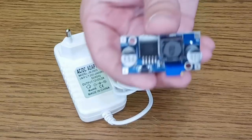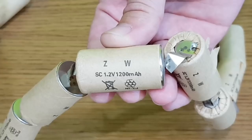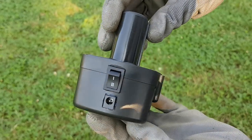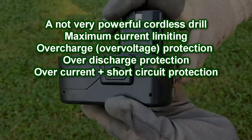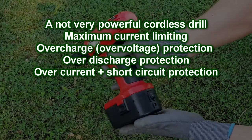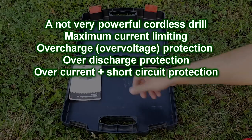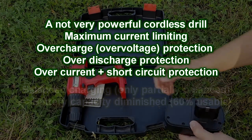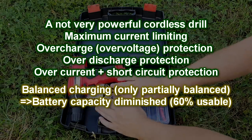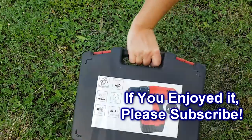The BMS board, charger, and step-up converter cost around 11 euros. Even though these old cells cannot be fully balanced, the usable capacity is much bigger than the original NiCAD battery, even when it was new. So let's recap: Is this conversion safe and worth making? Yes, but only under these conditions: the cordless drill must not be very powerful — if it uses 20 amps, a laptop battery cannot deliver that. The maximum current must be limited according to battery specs. Overcharge and over-discharge protections are mandatory; short-circuit protection is always welcome; balanced charging is a good feature but not 100% efficient with old batteries, and usable capacity will be diminished. I hope you enjoyed this video — don't forget to like, share, and subscribe.